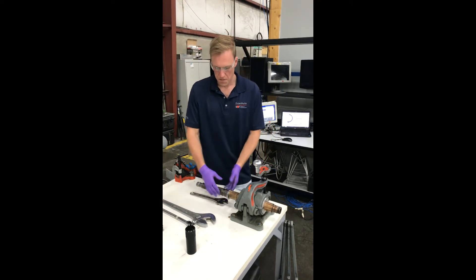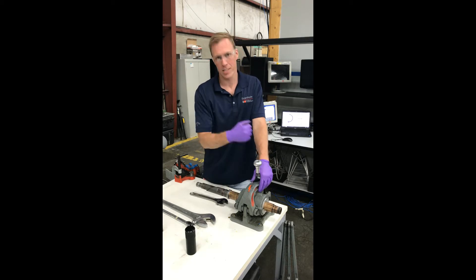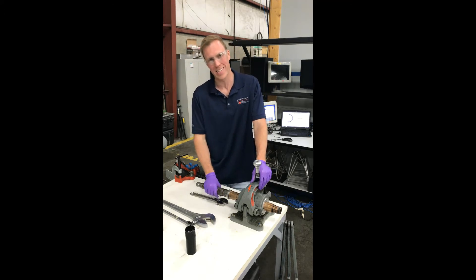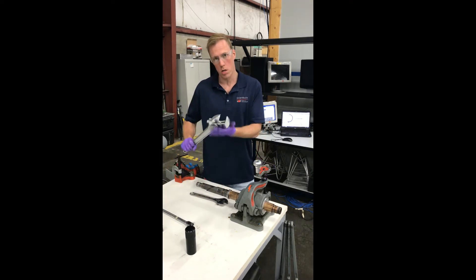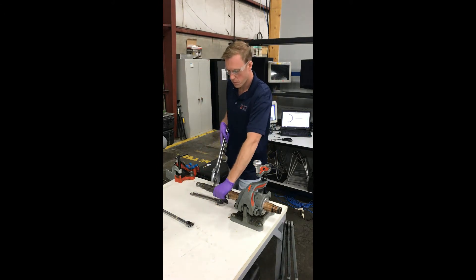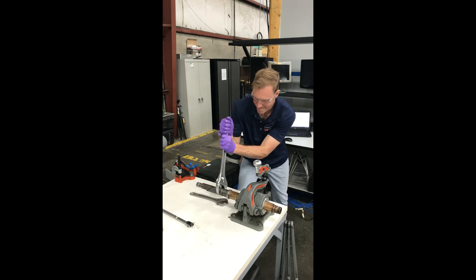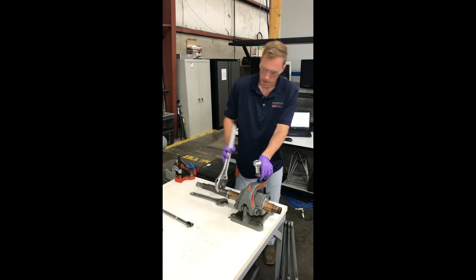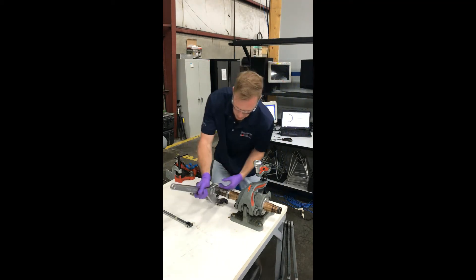The next step is to remove the lower assembly, which contains the signal shaft. There are four poly packs that act as a wiper inside of the ceramic sleeve, and we want to be able to clean and visually inspect the inside of that sleeve, as well as pull out a very large spring to clean and inspect. Once you grip it, you'll need a larger wrench — there are some flats on the bottom of the lower end. Get it in the vise and break that connection. The longer this sits after going downhole, the harder it's going to be to service with dried mud in there.